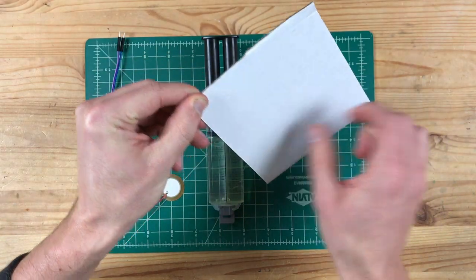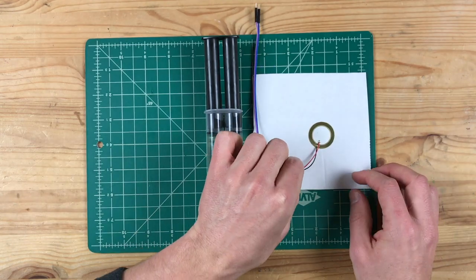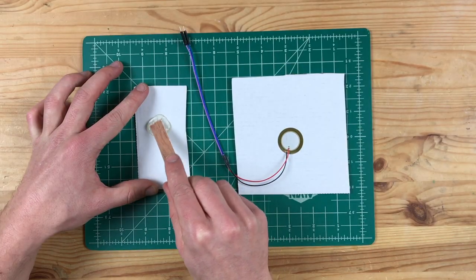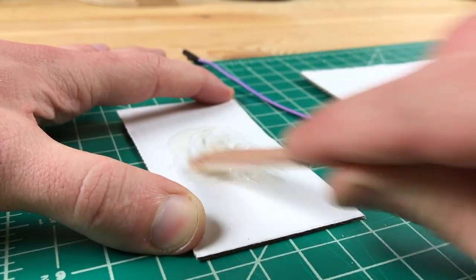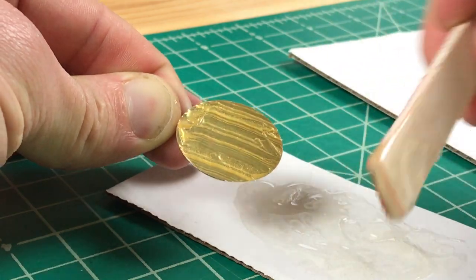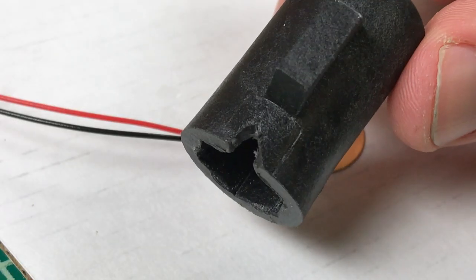The piezoelectric effect works in both ways. So you can generate charge by deforming a piezoelectric material, or deform the material by applying voltage to it. So you can use it as a microphone or a speaker or a variety of other things. For example, the first sonar machine used a quartz crystal to generate and detect vibrations in water.